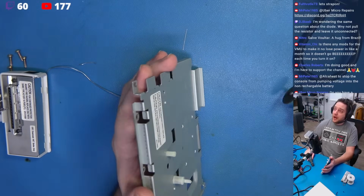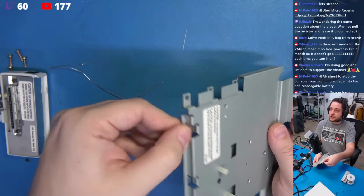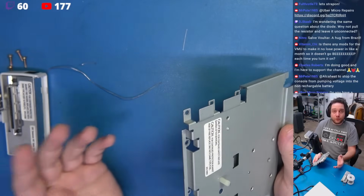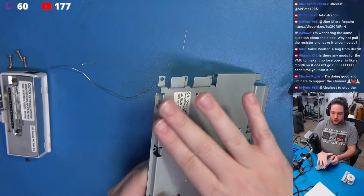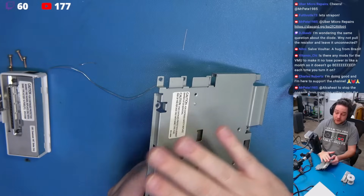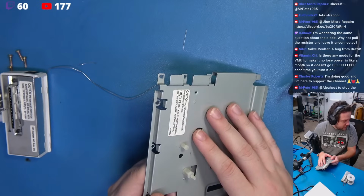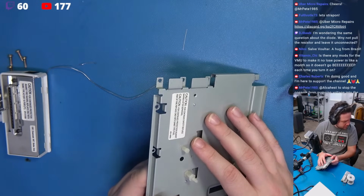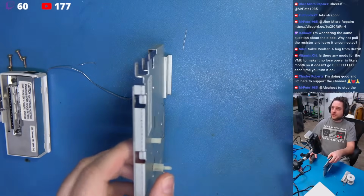But the problem with side cutters is if we bring side cutters in here and we take pliers to work this out, unfortunately you have a tendency of warping and distorting and deforming the rest of the metal, because as that metal fatigues, it's going to have an effect on the surface area around it. So looking at this picture, what I'm going to do is I'm going to take my cutters, and I'll try to do this on camera.